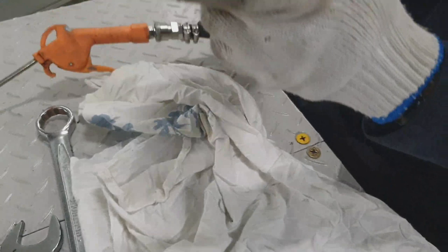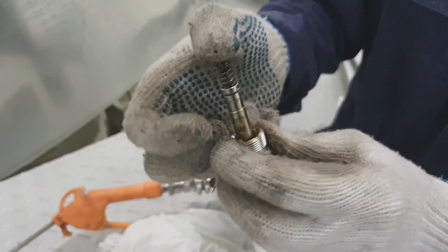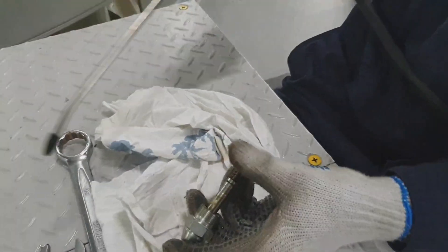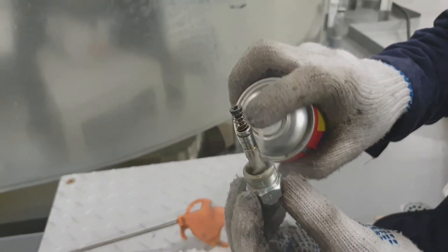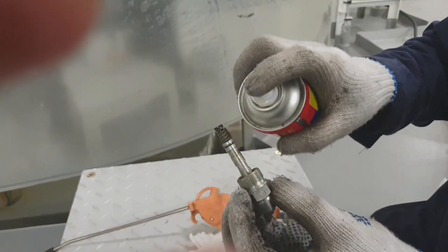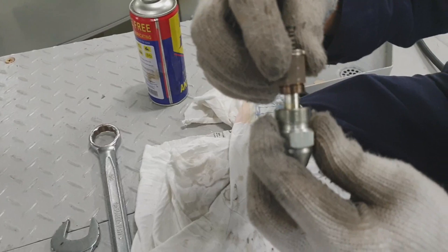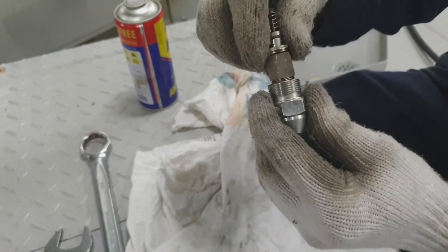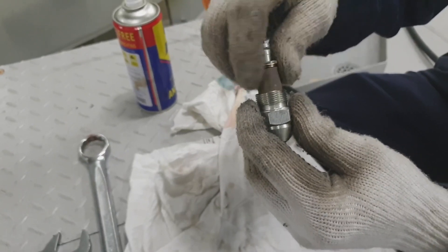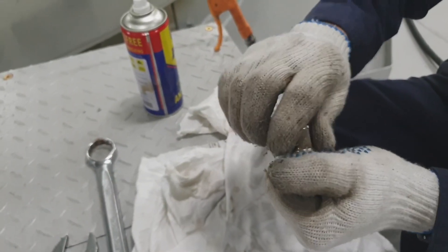As you can see, the spring I am operating is the non-return valve, which allows the fuel pressure to the main burner when the composite boiler is in operation, and prohibits oil droplets from the burner itself when the boiler is in stop mode.